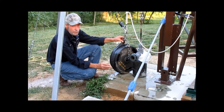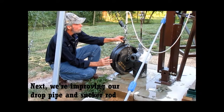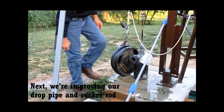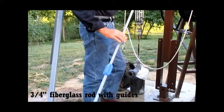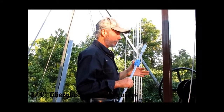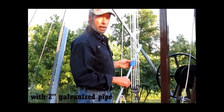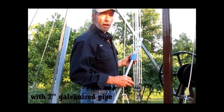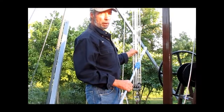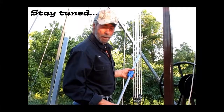Now on the short stroke it will pull up several more hundred pounds. I am getting prepared to install my new drop pipe and sucker rod. The sucker rod that comes with the Water Buck pump is 3 quarter fiberglass rod, with professional connectors on the ends — real easy to put together — and comes with the rod guides. I will be installing this with 2 inch galvanized pipe, 130 feet, and we are going to use a 4 to 1 block and tackle instead of a 6 to 1, using a windlass to raise, lower, and install the pump.